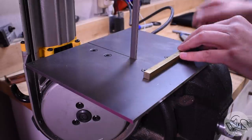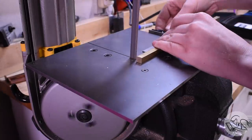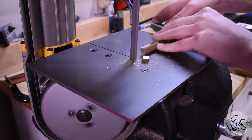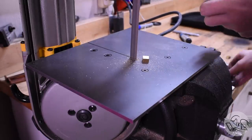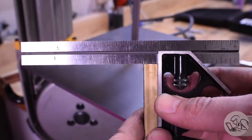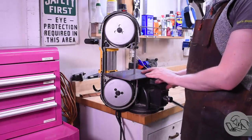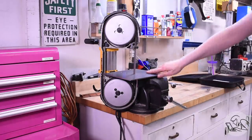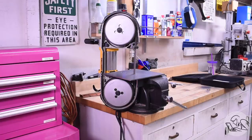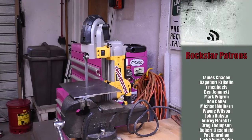Aluminum really needs lubricant to keep the blade from clogging up, so it cuts much better now with that on there. It's not going to win any speed awards — it's still a small low-power bandsaw — but it does cut that aluminum. Now let's try some brass round bar. I've got a clamp on there to keep the saw from grabbing it and rolling the stock, which can be quite dangerous when bandsawing round stock. That cut actually is outstanding — look at the finish on that cut. The table is certainly convenient, I love the working height of it, and it doesn't take up much space. Now let's see how square a cut I can get. I've got a square on the edge of the table — one of the reasons I went to the trouble of squaring up those edges so I could use them for reference. That cut seemed to go well and that's pretty darn square.